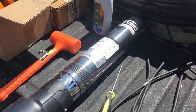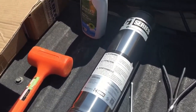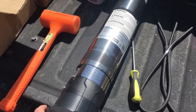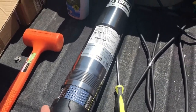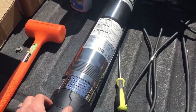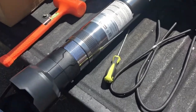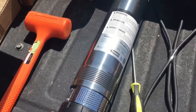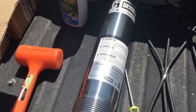The materials we need for this job are the pump itself. In this case I'm using the Franklin C1 10 gallon per minute cistern pump, not to be confused with the 20 gallon per minute version which is designed for septic systems. The 10 gallon per minute pump is designed to pressurize a water line for residential household use, and we sell it on our website.